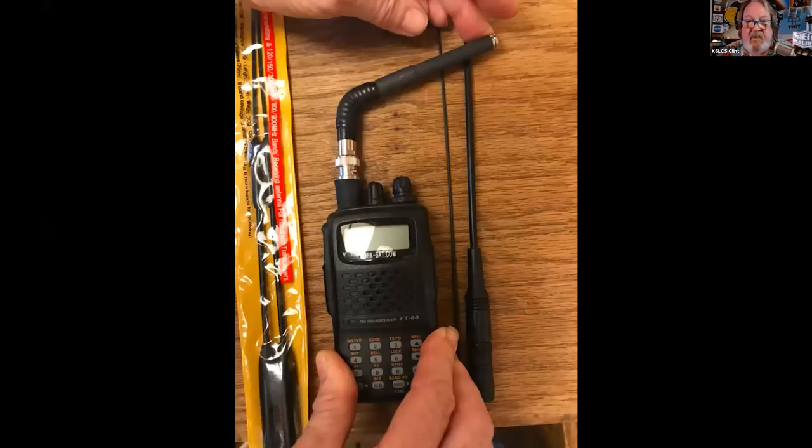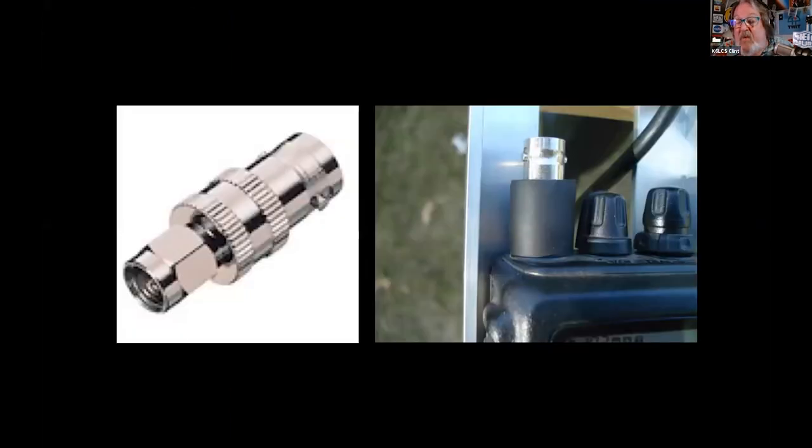Here's what you can do with that Smiley — I'm not damaging my HT connector at all, but that coil in the base is a loading coil that also protects your radio. If you're going to be changing antennas and playing with the satellites, think about protecting your delicate SMA connector. Quality SMA connectors are only rated at about 300 disconnect-reconnects, and if you're using one of the Chinese rigs, that is not a quality SMA connector. I'd rather see you wear out a $15 adapter than do a $60 repair job.